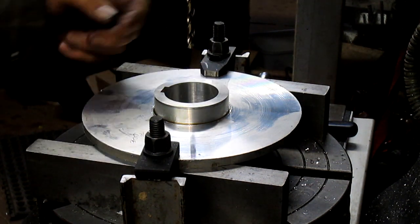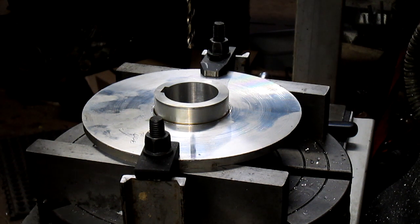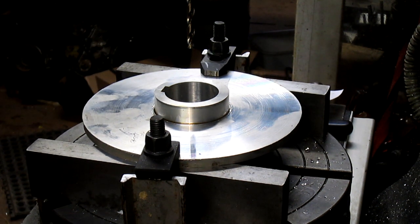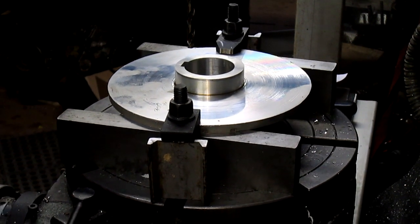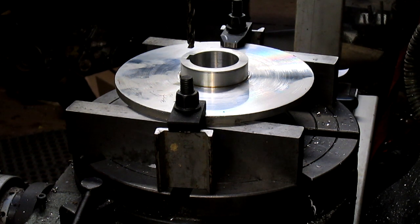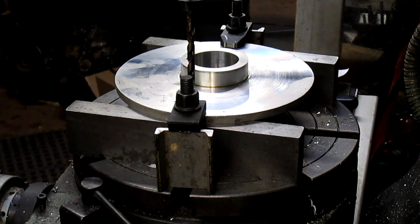Okay, we're zeroed out here, and we're zeroed out this way and this way. So we're set to go, and we're dead center, so we need to come out 3.487 from here to there. And let's go ahead and do that. 3.487. That drops us right there. We need to flip this around so that it's up there. And that's going to be easy.